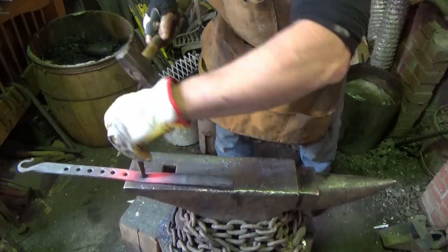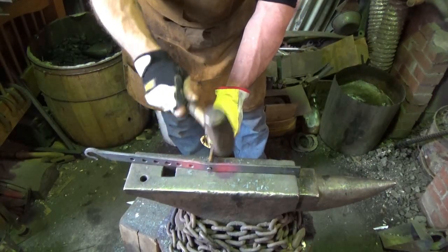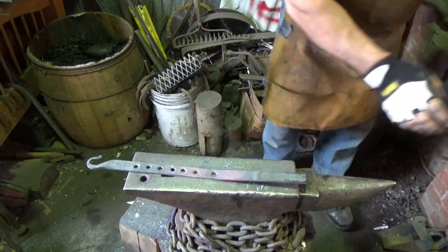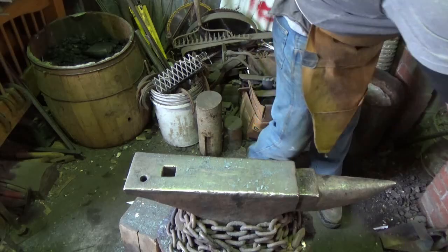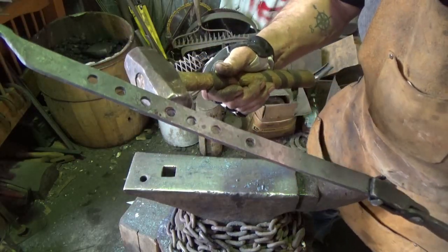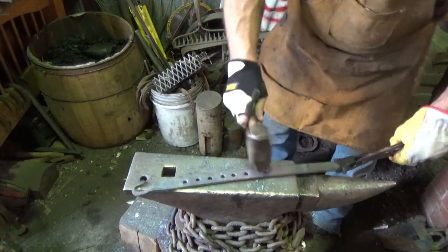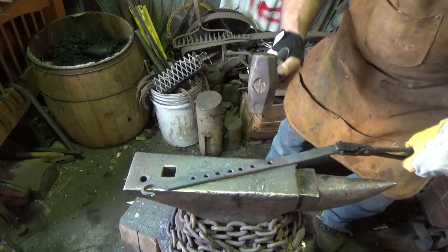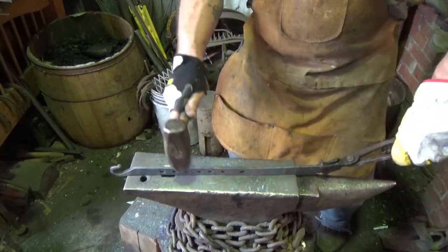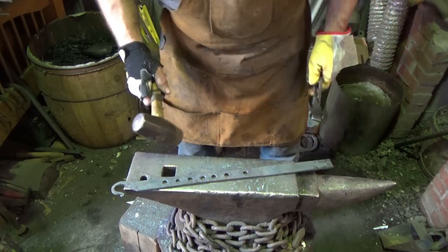After the punch I've been fixing my edge — moving that punch in — and that's been working really well. You can see this one has a little bit of a taper, and that one too — they're not perfect but pretty close. They can just be re-drifted to clean them up if needed. For this purpose I think that's fine. Oddly I'm getting a bit of a banana out of this and I'm not sure what I'm doing wrong, but I think we're happy with what we got.